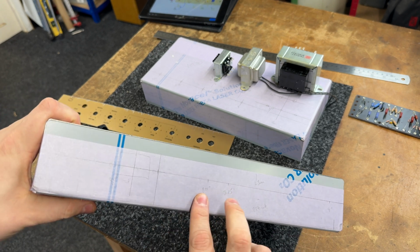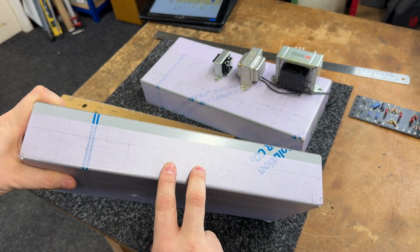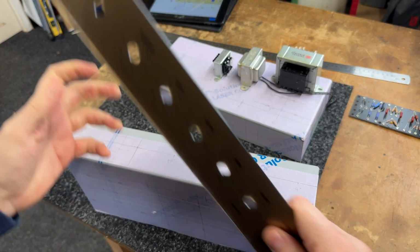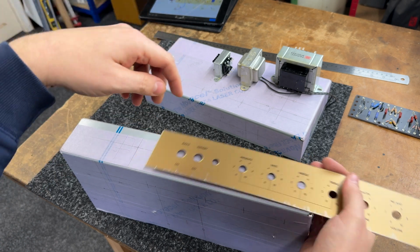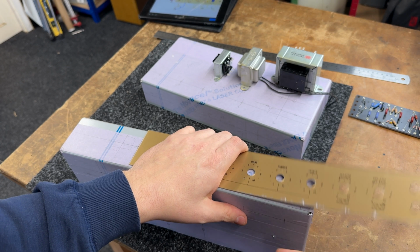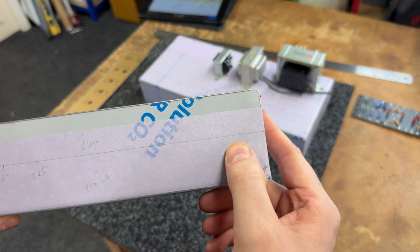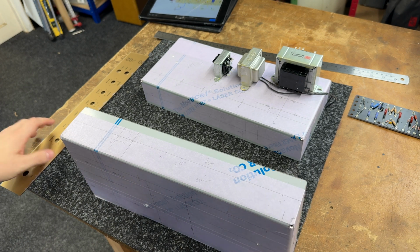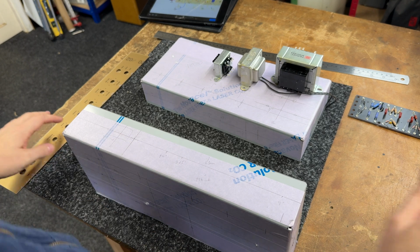We've got simple 8 ohm and 16 ohm outputs that are going to go there, roughly in the centre of the chassis, where I want them to be. But because it's going to be quite a large panel, and I know this is cut off, but just get the idea. It's going to be at least that long, isn't it? But it's only going to be held into place here. The risk is that this end of the panel will flap around. So we're going to have a tiny little mounting point there that we can run a machine screw through or something, just to hold that rear panel in place. I don't want to stick it down. I hate doing that. So yeah, these are coming along quite nicely now.